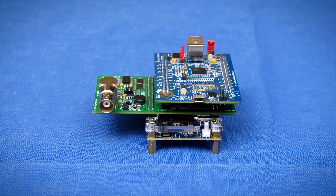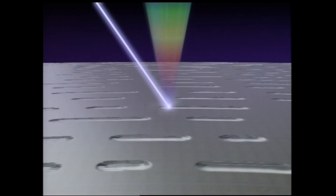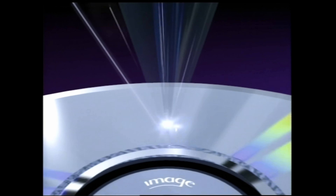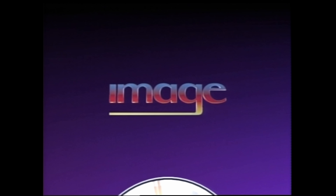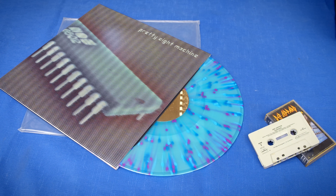But back to the hardware — the super fast ADC on this thing allows you to do some interesting things. Rather than capture the composite or S-Video output from the Laserdisc player, you connect to the internal analog signal from the disk directly and capture that before it has been converted to video, audio, and all the rest of the features you can get off an LD. As a clarification, Laserdiscs are very definitely an analog format. The laser does use pits and lands like a CD, but unlike a CD, the duration of these is variable. This works sort of like PWM, where you can change the time a signal is active to mean something more than just ones and zeros. But Laserdiscs use frequency modulation rather than amplitude, which means the time between pulses is the analog data itself. Just keep in mind this is an analog format, just like vinyl records and audio cassettes, despite using lasers.